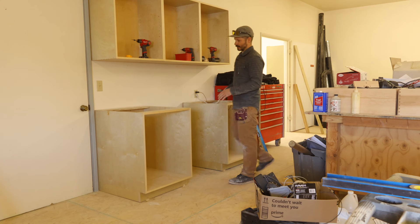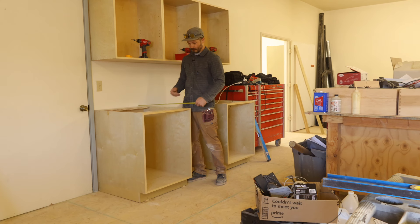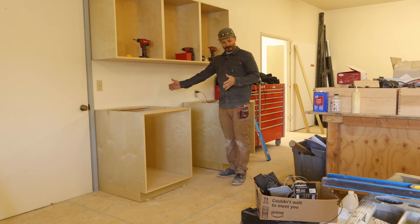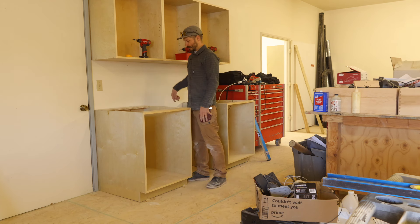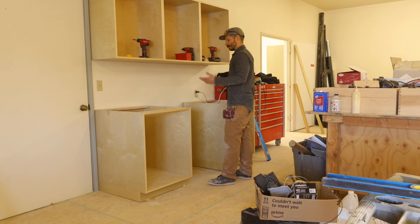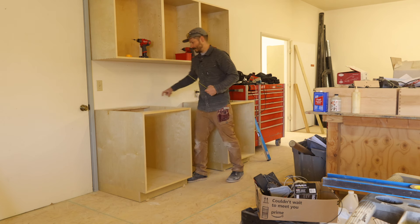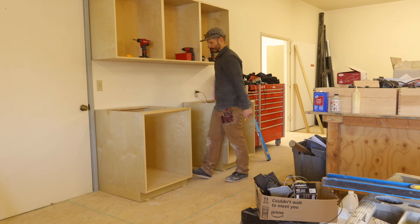I got the boxes set. These cabinets are actually really deep - they are 27 inches with 24 inch deep drawers. I have some pieces of melamine I've been saving to use for tops on stuff like this. Unfortunately I don't have anything that wide, so I'm going to have a piece in the back and biscuit it together because I want to use this stuff up - I don't want to cut into a brand new sheet of plywood. The wall is a little janky here so I'll rip a small piece for the back, scribe that in, and my front piece will just butt right into that.